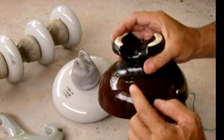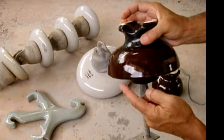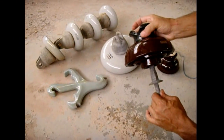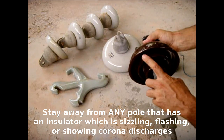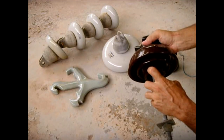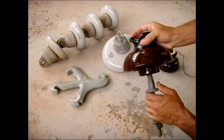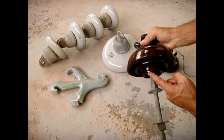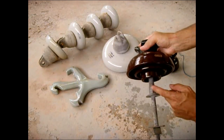If there's a lot of salt, the voltage can flash right over — you'll see a spark that goes from top to bottom, wrapping right around. But if there's only rainwater, the only problem you usually see is a little bit of corona trying to make it across these gaps. You wouldn't see a flashover like that. The ribs are also stepped in a fashion that makes it that much harder for it to jump to the rod.